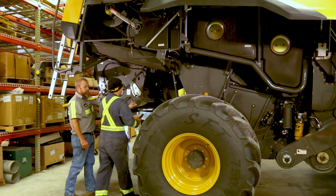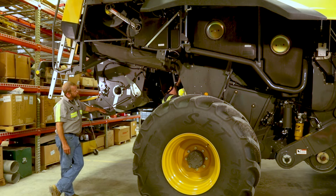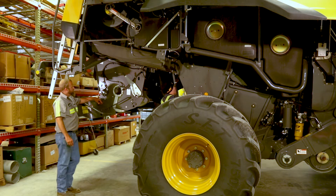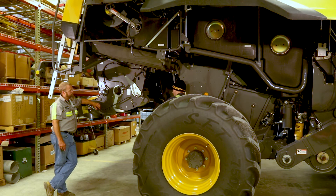There are some more bushings up inside. There are a couple on your main prep pan or main floor that's underneath the rotors, and a couple up at the front — a bushing pair on each one. It's a hard-access area; you pretty much have to close down your upper sieve all the way and crawl in there on a piece of heavy cardboard or plywood so you don't damage your sieves.